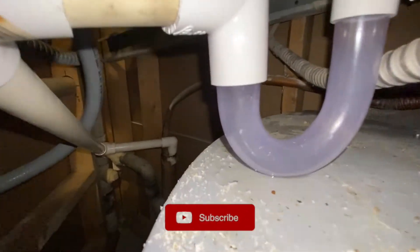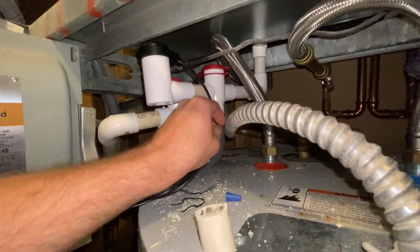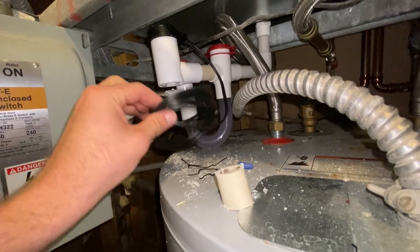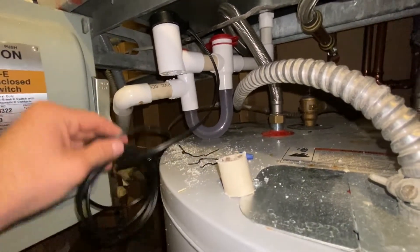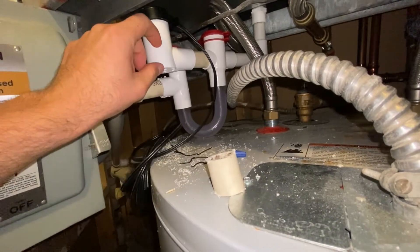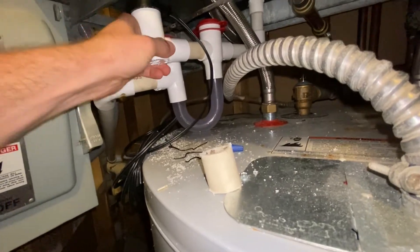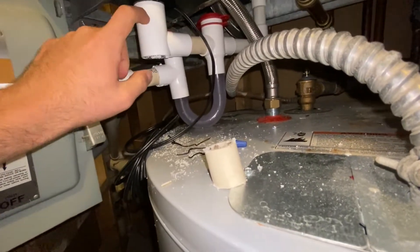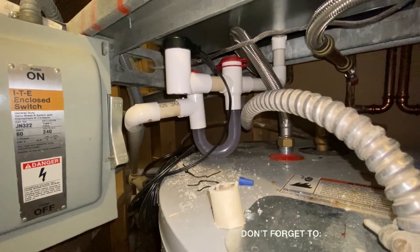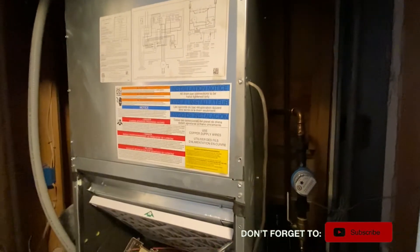You can see it drains all the way down there to the drain. So now what we've got to do is put in this cable. This is a 24-volt cable and this will tell the thermostat to turn off once the overflow sensor is tripped. It's a normally closed switch that is opened once the water fills up to a certain level.